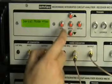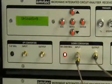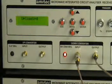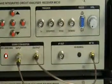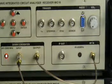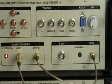There is a control for serial mode equal to yes. When we press enter, the instrument starts to upload the different frequencies and level data stored at its 1000 locations to the serial port. The serial port has an RS-232 connector. This connector can be connected to the PC using the software, and the 1000 frequencies and 1000 level data stored at the memory locations can be outputted to the personal computer for visualization and interpretation of the data.